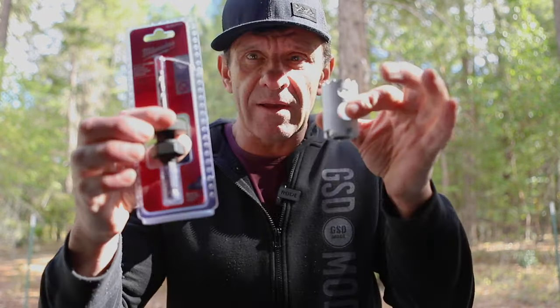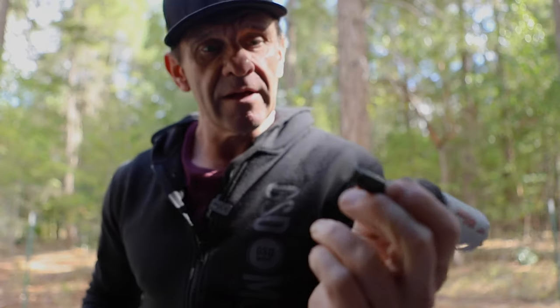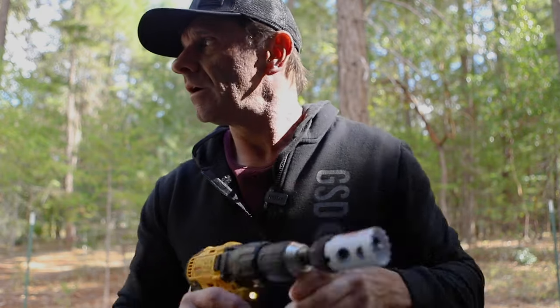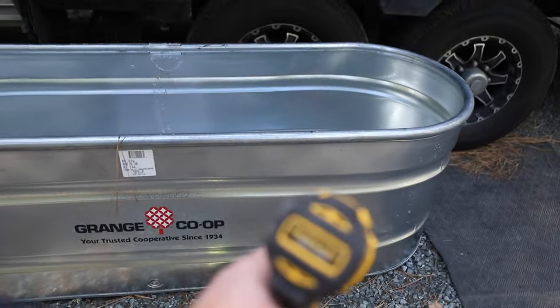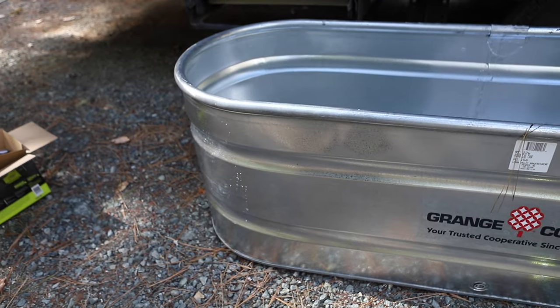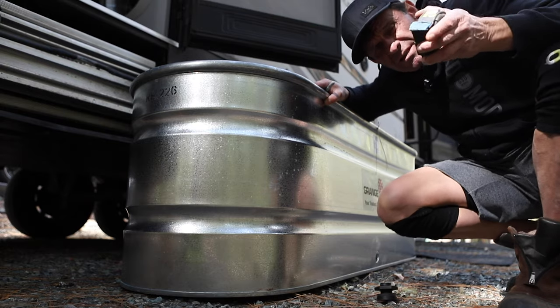Just don't make the same mistakes I did — make sure you get all the right parts first, then put it together. The parts list will be in the description. This piece is a half-inch shank — please fit in my drill. What a relief — it's going to work. I'm going to put the hot water one there and the cold water one there. Heat rises, so the inlet should be on the bottom, and I want them far apart so it'll circulate. I'm going to measure — this thing starts to curve around 20 inches, so I'll go 20 inches over.